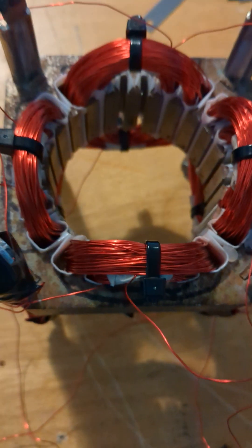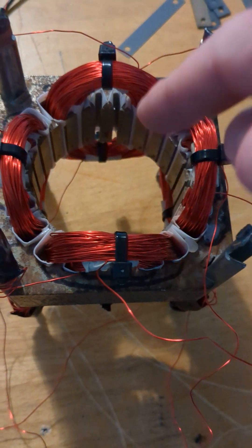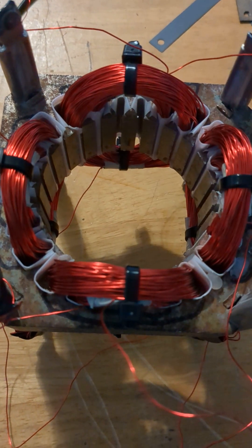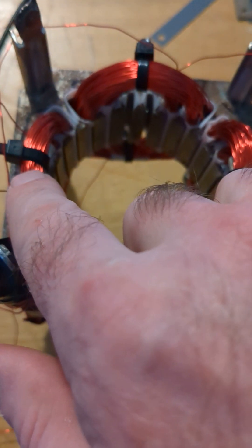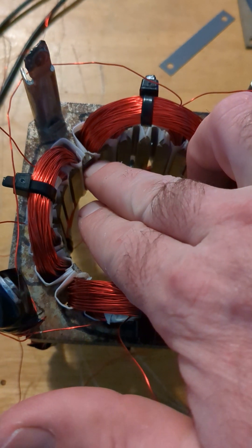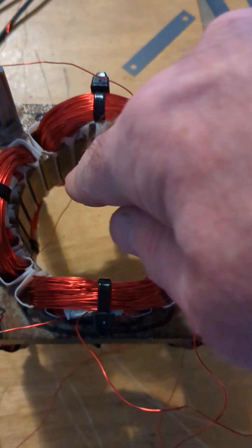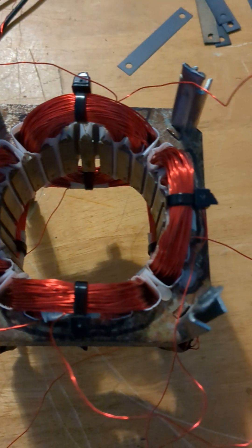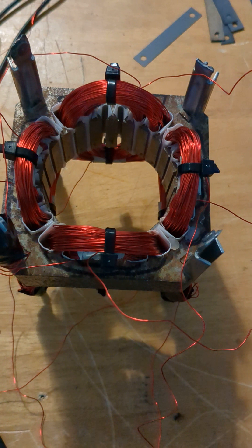Without a shadow of a doubt this thing is rotating. I used an induction coil to watch the scope to see if it's totally even all around, and it's not. It's perfectly even at the faces while it's in front of the coils, but when it reaches the 45 degree angle between the coils we start losing induction because of the gap right there, and this isn't solid.